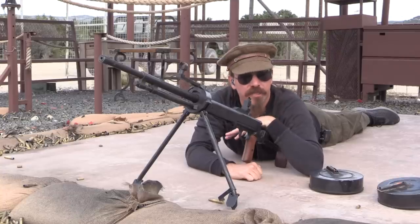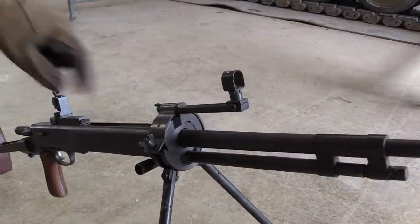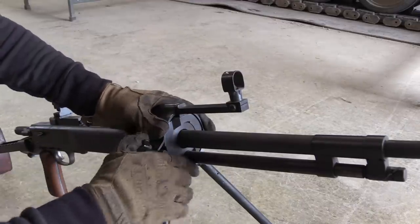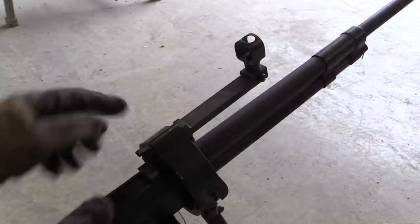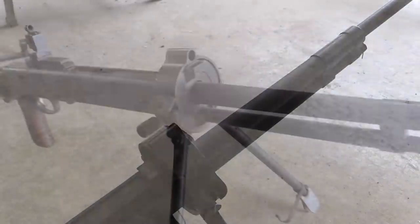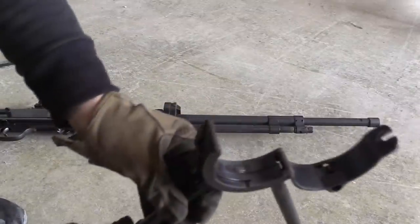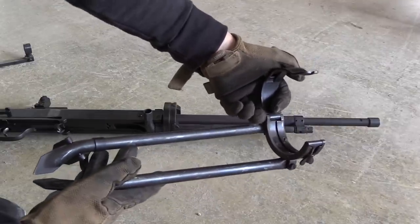These were used in pretty much all the Soviet tanks — in particular the T-26s, T-34s, and KV-1s. The bipod works via a thumb screw. I have gloves on because I'm doing this after we've finished shooting and the barrel is a little toasty. So this unscrews, we can flip this up, and I can push in on this little spring and pull out the whole front sight assembly so it stores in the tank. Then this lifts off, and now the gun is ready to be installed in its ring mount in the tank, with the bipod unit stored alongside the front sight.